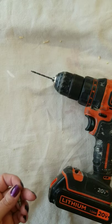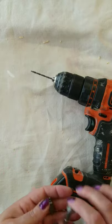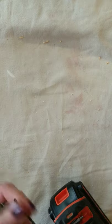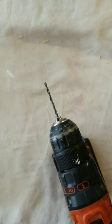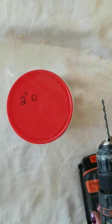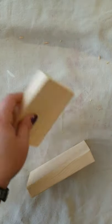A Phillips head I don't need — I'll stick that back on my drill. A square head, because that's the kind of screws that I have. And I have a small bit for pilot holes — again, I don't know what size it is, I'm sorry about that. I have two-inch wood screws — overkill, yes it is — and one and a quarter inch. They do go in like butter when you buy wood screws, but if you don't have wood screws, these are actually drywall screws, but they work too for the project.